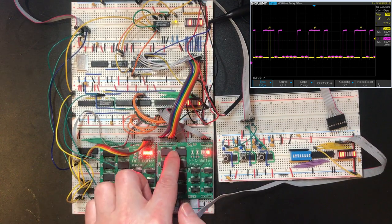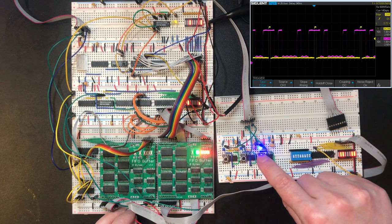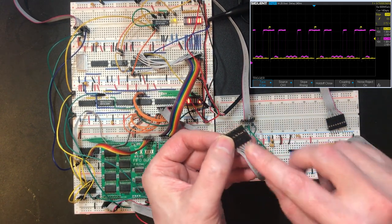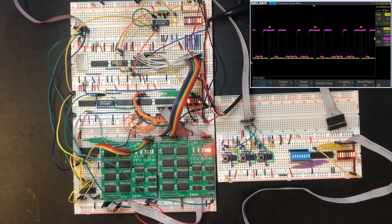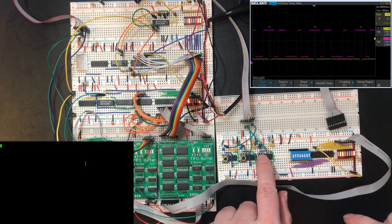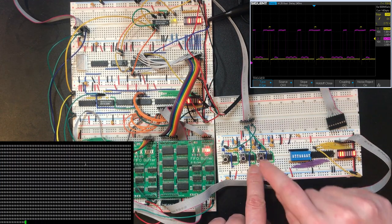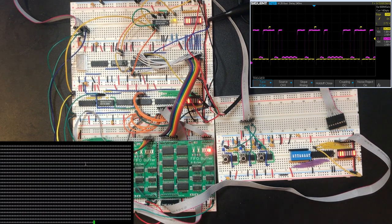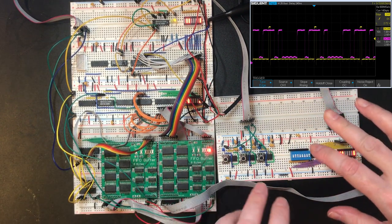We're not getting the right output out of the FIFO. Look at that. One of my pins is off. Put that back to A, send it. Got some bounce on that button. Finally, we're getting the lowercase a we wanted. Okay, this is actually promising.